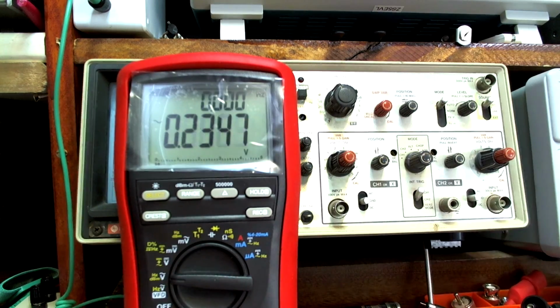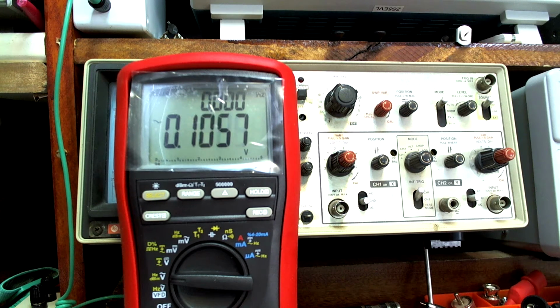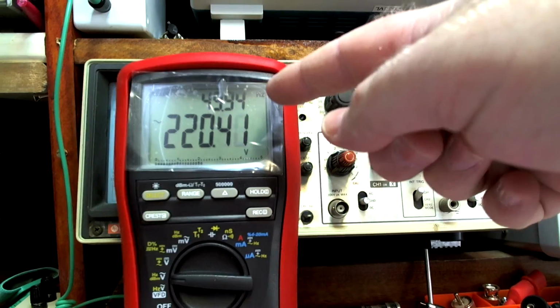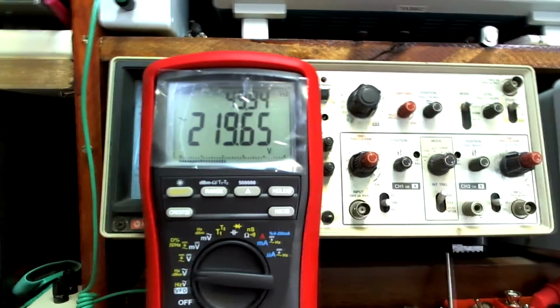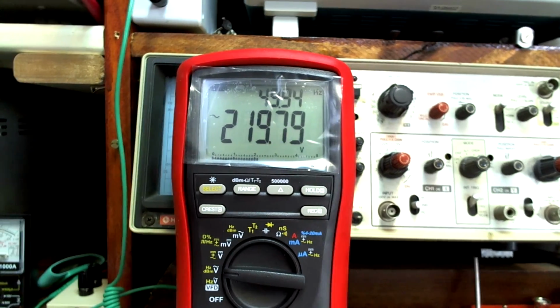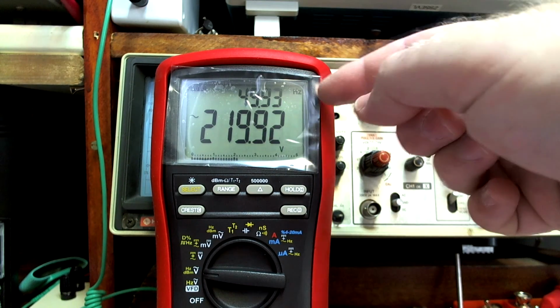We're going to go across to volts AC, and what we're going to do next is technically plug the meter in and just see our AC voltage measurement. And what is nice again with the Brymens is that you've got your 49.94 hertz, well, not duty cycle, but your cycle frequency, and you're showing your 219.71 volts AC. Now, something else that's quite nice, let me just rotate this camera back to center. So something else that's quite nice that I appreciate is having that frequency on display.